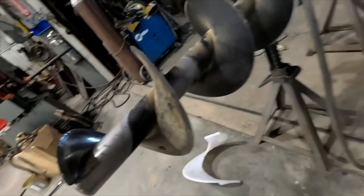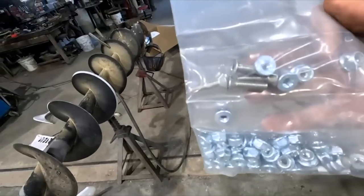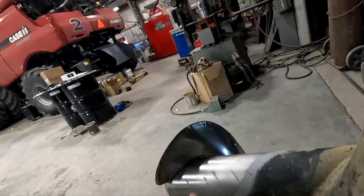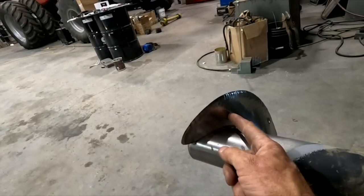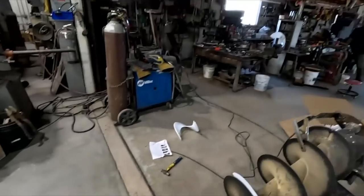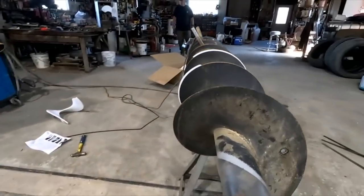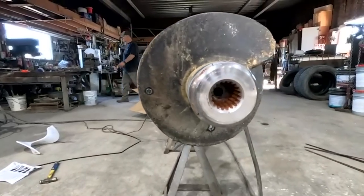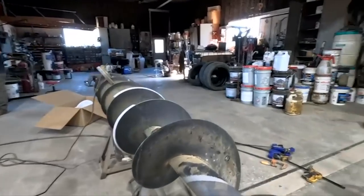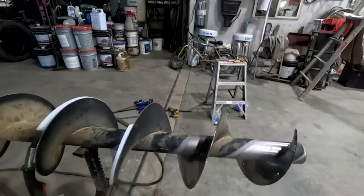We'll have two more here from these starter bolts. We're doing both combines, so we have enough of those. Put a bolt here and a bolt here, since this is your leading edge that's pulling the grain up out of the bottom. Warren's trimming this because this flighting is obviously narrower than the main flighting up to two. So he's going to trim that piece off real quick, and then we'll get going again.